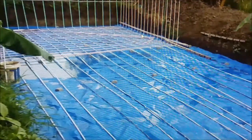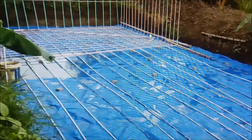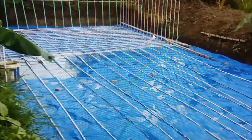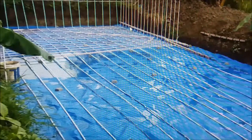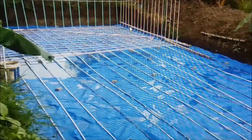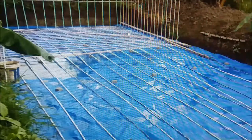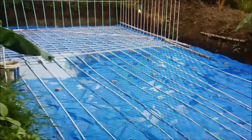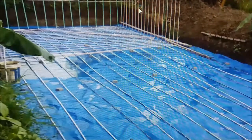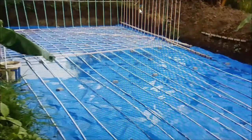What you can see in this picture are notched boards — boards with notches in them — and the notches are the rebar spacing. You can have a rectangular or square grid with different notch spacings. The notch boards have at least two sides with different spacings. The grid on this tank is number 12 bars on seven and three-quarter inch centers, and every bar goes up the wall 42 inches. The top of this tank will be 36 inches — three feet — which is a meter minus three inches.